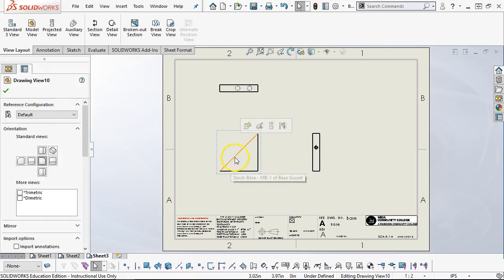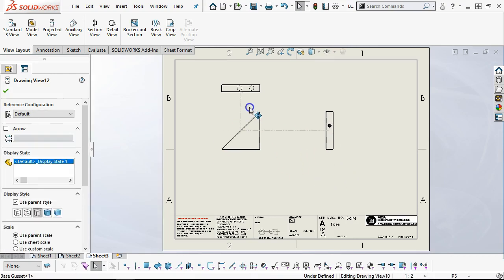So even though it doesn't need an angular tolerance, I'm going to say this is our chance to put an angular tolerance on. So we do want to ensure perpendicularity here because that is supporting that vertical. And other than that, we could have a fairly wide open angular tolerance here, but this is the only piece that I really encountered that would be able to take it. So in this case, we don't really need, let's see, how could I manipulate that?